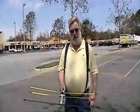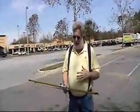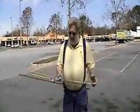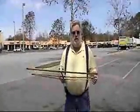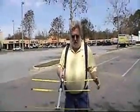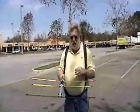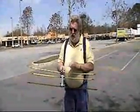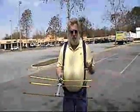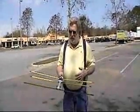David Rockey, N4WQF again. Now we have a Yagi antenna we use for fox hunting. This can be built real cheaply. It's made out of tape measures, and the nice thing about tape measures is when you're fox hunting and you hit something, they'll bounce right back — it's a very durable type antenna. You can carry extra radials if you need to. PVC pipe for the center. The total cost might be about $15 and a couple of hours to put it together.